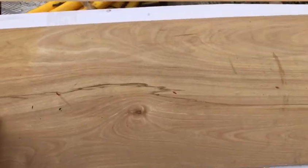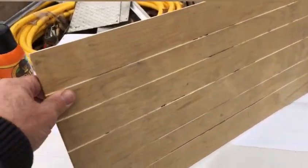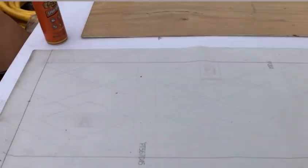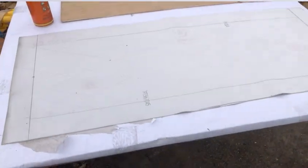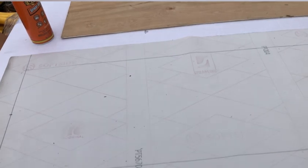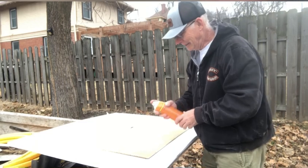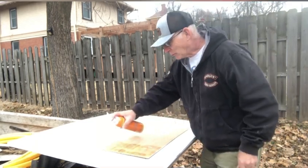I'm going to run my board pieces — run me a little thin board through the table saw and then put some kerfs in it. That way it bends, and then use the old Gorilla Spray. Spray that down, put this on there, and then I'll end up screwing it on there. Follow along as I show you how this works. First things first — got to give it a good shake here. Spray the board down real good.